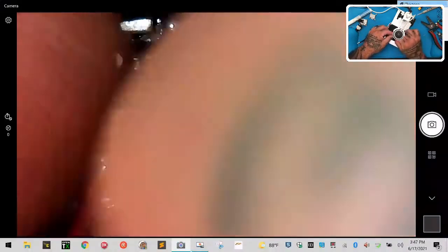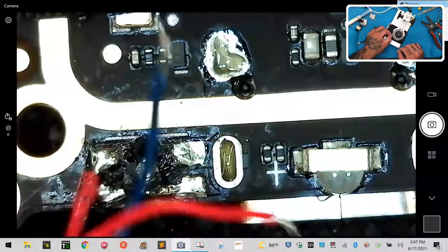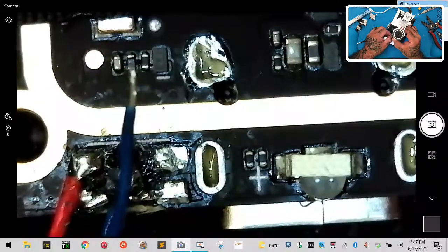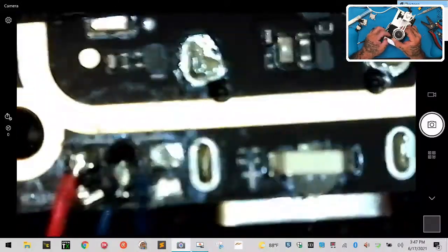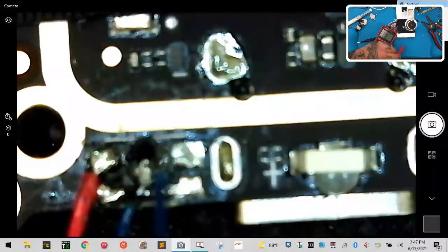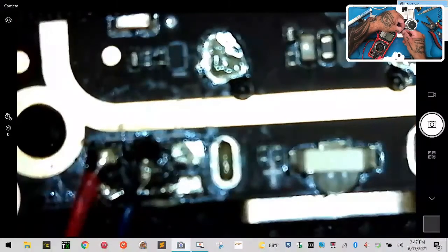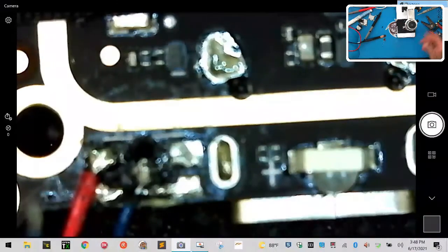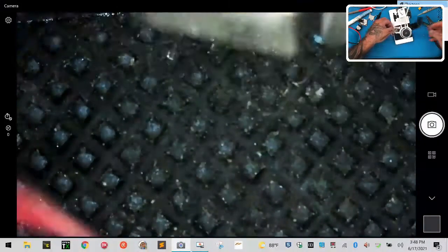There you go - so that should do it. Now I'm going to cut this end off of the wire as you can see, and strip them and make sure that there is no continuity between these two, which would tell me that my soldering is done clean. Bear with me a second - fat fingers at 200 times magnification are like super fat. Alright here it is - there's one, two. As you can see they're stripped here. Now I'm going to put the tester to it - let's see if we have continuity or not. We are now officially touching both of them - there's not. But if I touch the ground I should - excellent. And if I touch this one with the ground I should not - excellent. That pretty much does it.